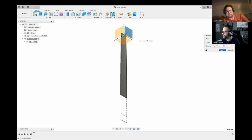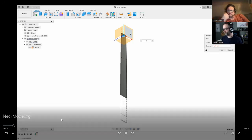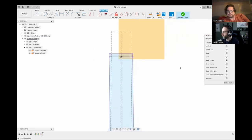What I'm doing here is building the origin plane — the plane the sketches are on is going to be the fretboard gluing surface. So I'm creating an offset plane that's the thickness of the fretboard plus a tiny amount, usually like 0.2 millimeters. I just want the body of the neck to slightly overlap the cutting tool for the fretboard surface. I'm setting up the plane for the top of the fretboard and for the bottom of the heel, which is also the bottom of the headstock on a Fender style.